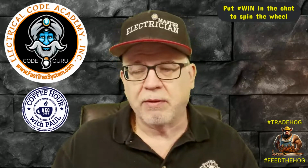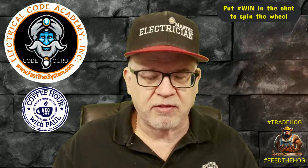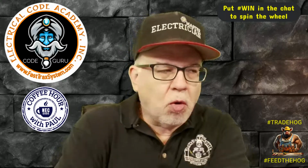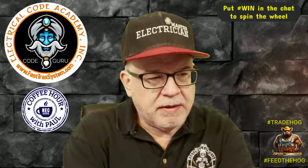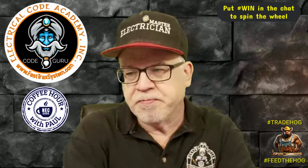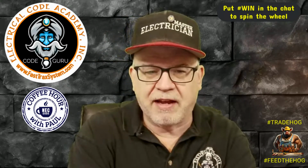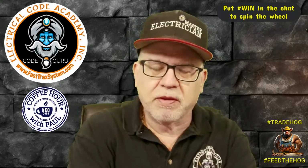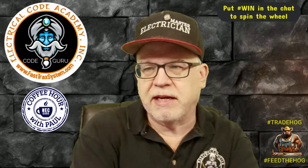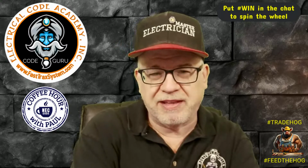We're just talking general, and we're ending up this series on cable tray, and we'll talk ampacities today and be very general with the ampacities, because I'm sure when we talk about ampacities, it generates other questions. The goal is to not make cable tray and ampacities complicated, because it can be complicated where it can cause us to look at 310.14(B), which is engineering design, and an engineer might be able to use something called Neher-McGrath, and they can do a calculation that would generate a conductor value where a conductor can handle more current than it would using the tables in the NEC.